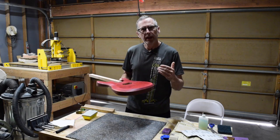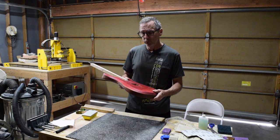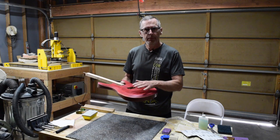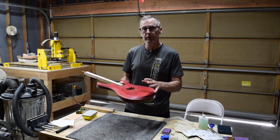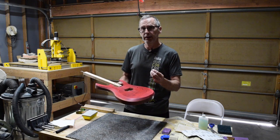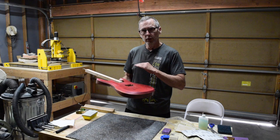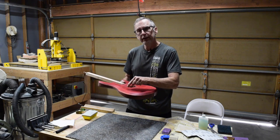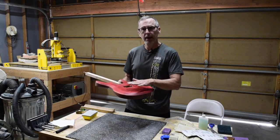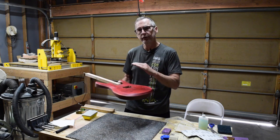The question you probably have is: how do you know when you're done level sanding with 800 grit? What you're going to look for is a consistent flat matte sheen. When you started out, the surface was probably fairly shiny, and as you begin to sand, that surface gradually converts to a flat matte sheen. You want to check at a low angle under a bright light that there are no shiny spots left. Shiny spots are going to be the low areas and the flat matte sheen is going to be the high areas. Once you have removed all those shiny spots, you have a level surface.